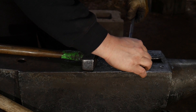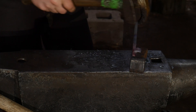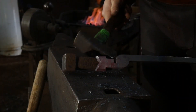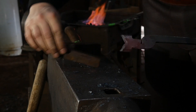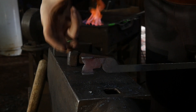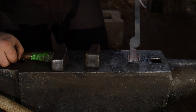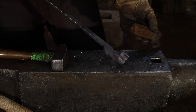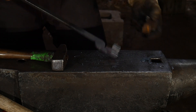If you want to adjust this to whatever bar stock you're using — say it's one inch wide, or 25mm wide — you put that in here. Say maybe that's one inch, you would put that in there like so, and then dress these up. You'll probably want to wait on dressing until you've made your bend and put your other jaw together, so whatever adjustment you need to get them set up will be easier. That's one inch — I just adjusted them to hold one-inch material.